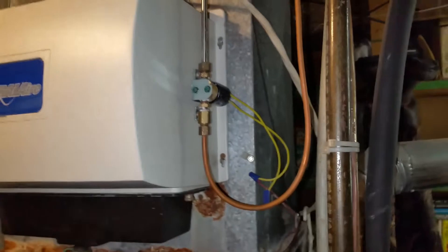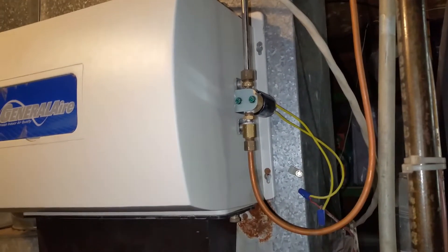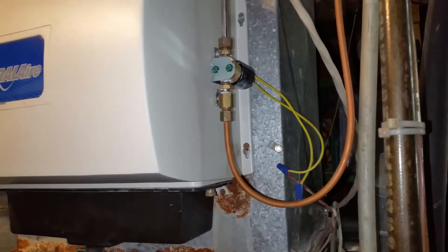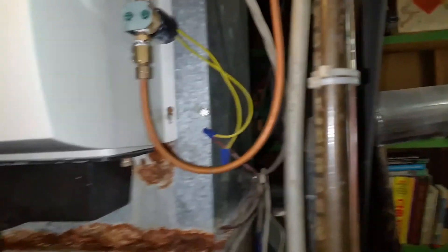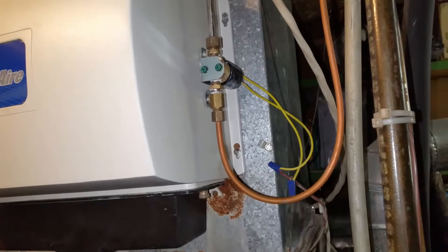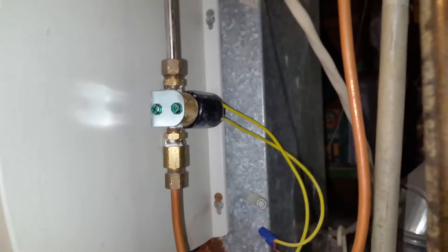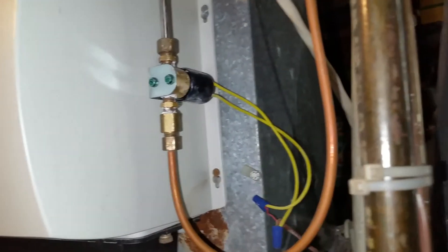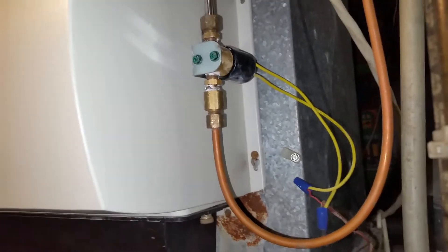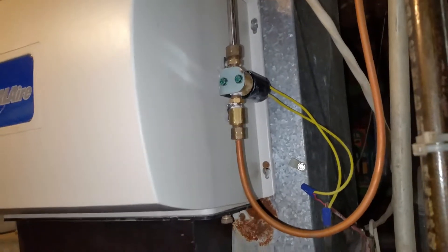These things sit over the summertime when they're not in use and they get sticky from all that rust. If you have hard water, rust is constantly accumulating on metallic pieces inside the system, and when they don't move for an extended period like during the summer, they tend to get stuck. It's actually been about a year and a half since this failed on me — I hadn't bothered to change it until now. The actual water valve on the other end also became seized and broken, and I had to replace the saddle tap on the water line on the other side because that had become corroded and clogged up as well. The solenoid is a simple repair you can certainly do yourself — it's very simple. Thanks for watching. Think about doing some of these little home repairs yourself and save yourself some money. This was $31, which is a small expense compared to probably a $200 bill to have a service tech come out and replace that valve. Have a great day, bye for now.